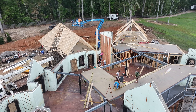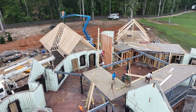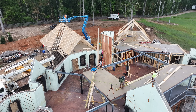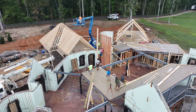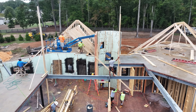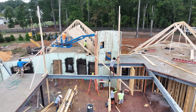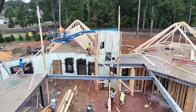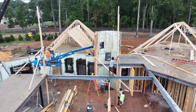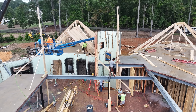What I'm trying to do is get the boom lift as close in and as tight where we can still maneuver and reach where we need it. It works out, but it's close. This one has a ton of capability — two different vertical booms. The crane is going to come across and just set the double LVL right on top, supported by everybody holding it in mid-air, and then we bring a rafter in from each side and nail it in place.